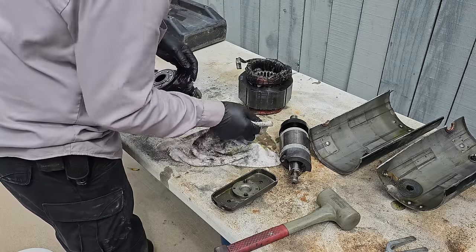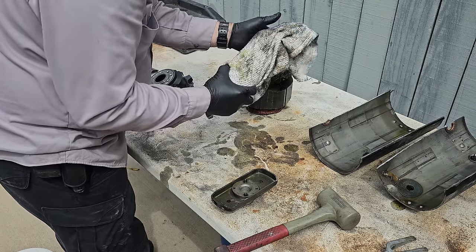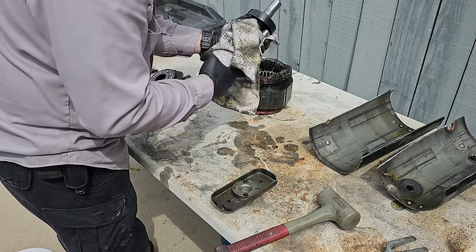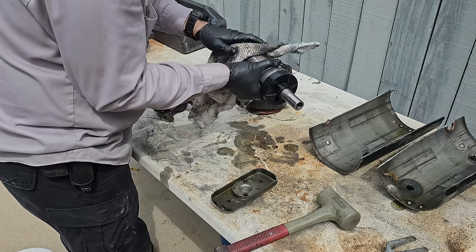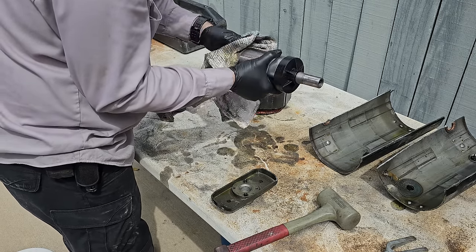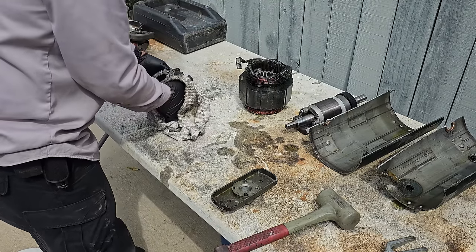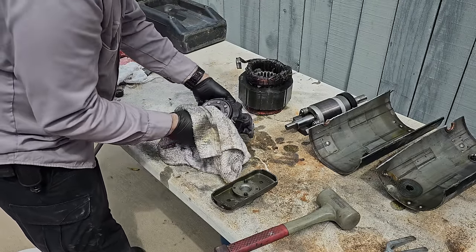Things are messy when you do this, so always make sure you've got lots of towels in a place where it's not going to get ruined. This table is my compressor cutting table so it's destined to be nasty. I like to start by wiping everything down, getting the bulk of the oil out, and then we'll really analyze it once we get the parts cleaned up. We definitely know there's a problem in the compressor windings, but I want to know if there's any damage inside the scroll plate assembly.